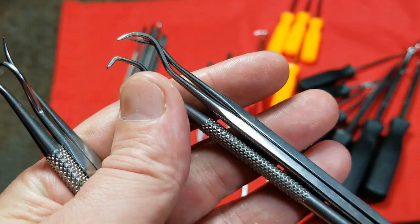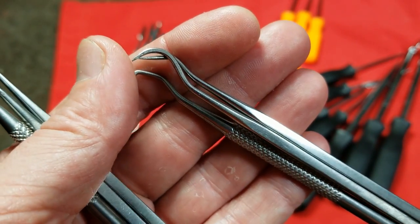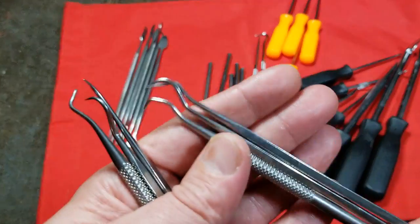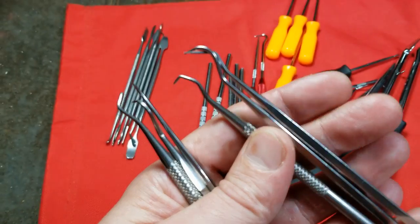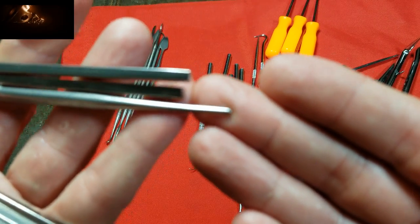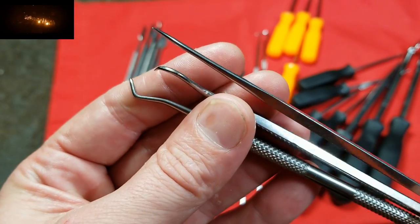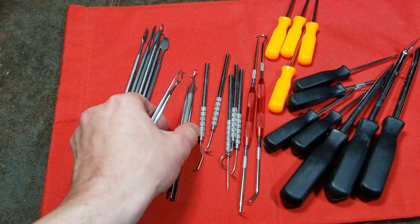The set does have some pretty deep knurling. The single-ended ones are a 45-degree, a standard hook, and a compound hook. Some tips are sharp, some are blunt — I'd actually blunt them a bit more for o-ring specific use. Many o-rings are in aluminum areas and really sharp tips can scratch those surfaces. The round one has a ground point on the back, maybe for depressing reset buttons. The remaining picks are standard hooks — a light curve handy for electrical connectors, a standard hook, and a compound hook. Being stainless steel, they're more durable and won't rust.